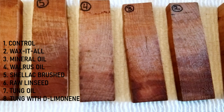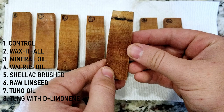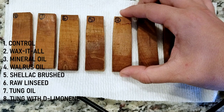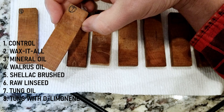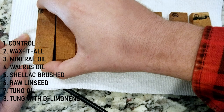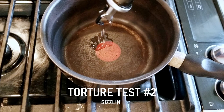Right now we are looking pretty messed up on a lot of these. The first one is the control — definitely some water damage, and the bowl clip paint actually melted. Number two did not fare too well — you can see the water line near the top. Number three did okay but there was some major swelling where it was submerged. Number four had some discoloration and a decent water line. Number five completely discolored. Number six didn't do too bad — color stayed relatively consistent and there's no water line. Numbers seven and eight did really well — that's the tung oil. There's no swelling, minimal color change, and absolutely no water line.